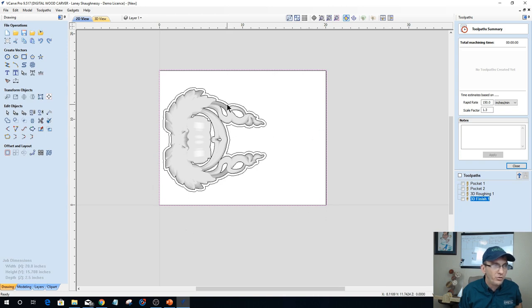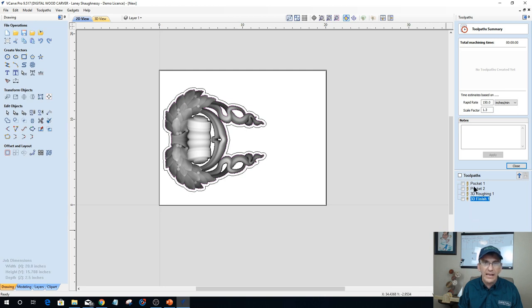We drew a large boundary around our model, and we used a large end mill, quarter inch, half inch, whatever, and I used a half inch to do all the major flat work, cutting down to the bottom of that model, that 6512. And then we used a smaller bit to come in and do all the other little pockets, all these other little pieces of wood that would be sticking up. It takes about 30 minutes to clean up those areas.